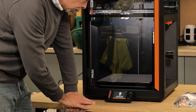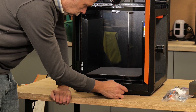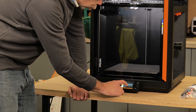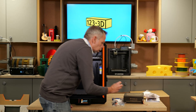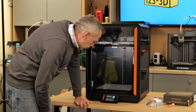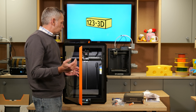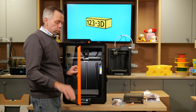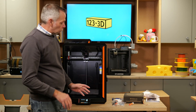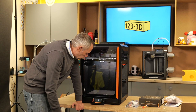First off, select English. The printer introduces itself: 'Hi, this is your Prusa Core 1L printer. I would like to guide you through the setup process.' I'll skip Wi-Fi for now. The printer reminds you that before use it's necessary to remove the three screws securing the heated bed during transport — very clearly marked with a little sticker, so make sure you do that before proceeding. Do you want to enable the door sensor safety feature? Basically, if you open the door, the machine knows and will pause printing — a handy safety measure, especially in an educational environment or if you've got small children around who you don't want messing with moving machinery. We shall have that on; you can turn it off if you don't want it.